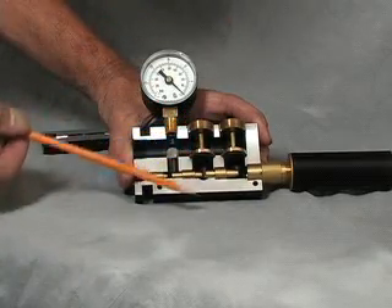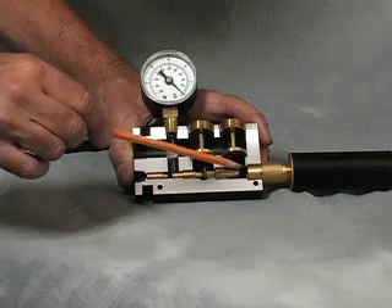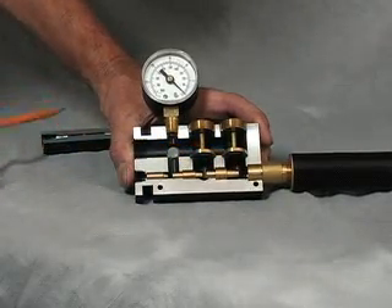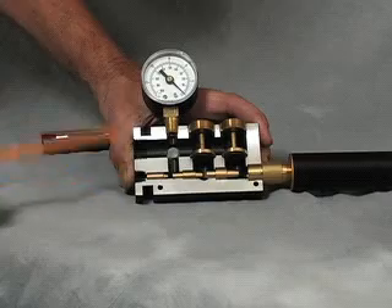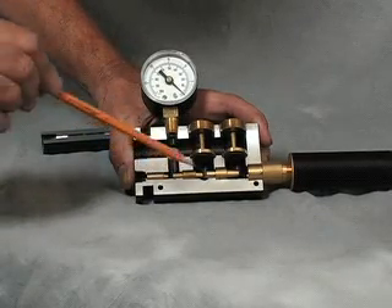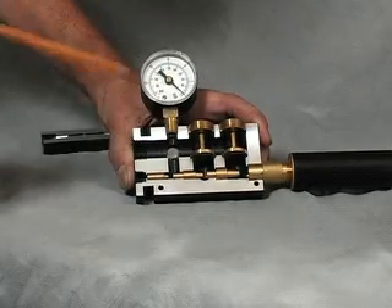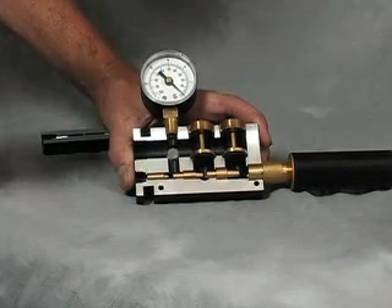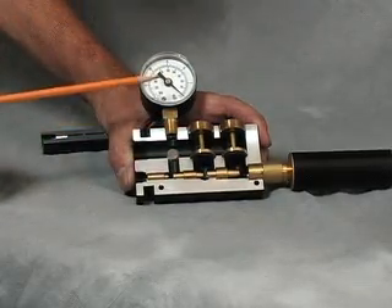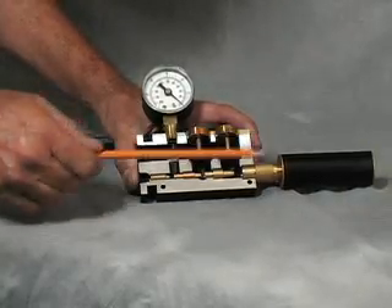To go even further, we put it through another stage and create vacuum in a third chamber. So unlike the single venturi where you only manufacture vacuum in one area, we do it in one, two, three areas. What we get out of that is the efficiency of using that compressed air three times. The benefit to the customer is less compressed air consumption and more vacuum flow.